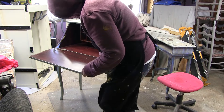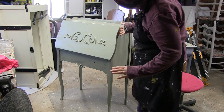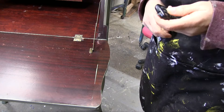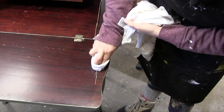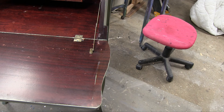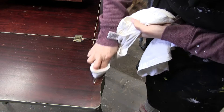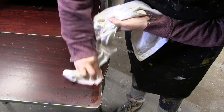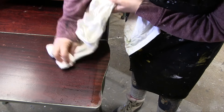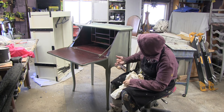The desk got one coat on it — I got it painted all the way down. Let's let it dry. We'll see if there are any other repairs we need to make, and then we'll get back to second coating it. Here's a spot I was talking about — when I leaned it up against here, it got into the side of the paint. If it's wet you can wipe it right off, but if it's dry, just make your rag a little wet and it'll come right off. That's also how you do the wet distressing.